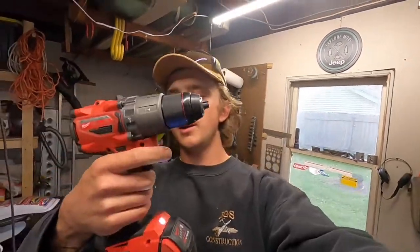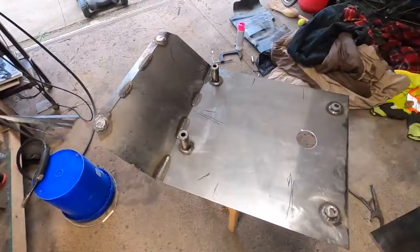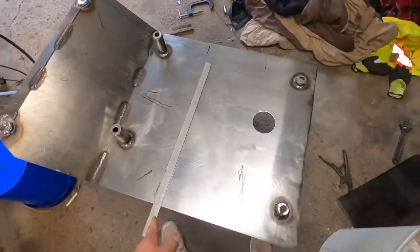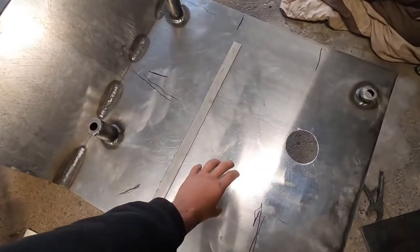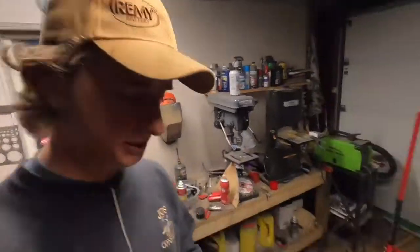We're back working on the skid plate now. Got a new drill — it's the Milwaukee Fuel — and a new piece of metal. I actually messed up measuring and my mounts were about a half inch off, so I cut my losses and got a new piece. Don't worry, that piece I had before is gonna be the next project for the next video, so stay tuned. We're taking these strips from the first cut and adding some ribs. Here's where the diff sits, so you want to make sure you don't run right into it. Just finished welding all the gussets in.